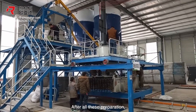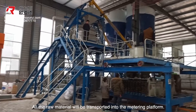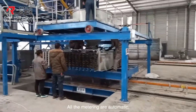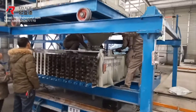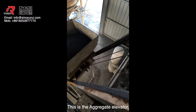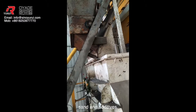After all this preparation, let's look at the main production process. This part is the fitting and metering. All the raw material will be transported into the metering platform. All the metering is automatic so that it can guarantee the formula is accurate. This is the aggregate elevator, mainly used for transporting the aggregates, the sand and additives.